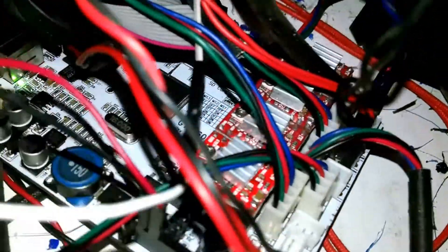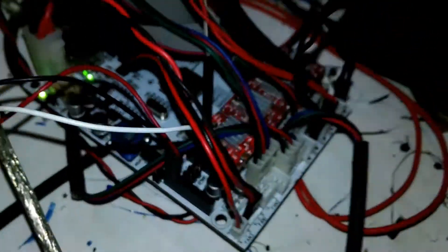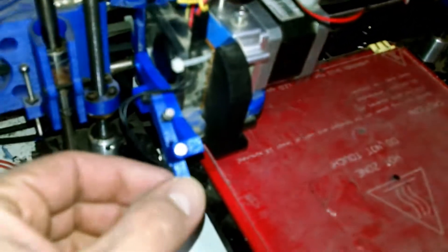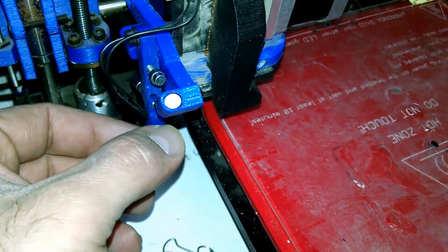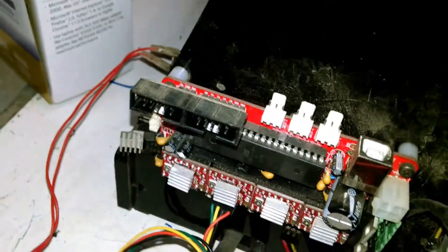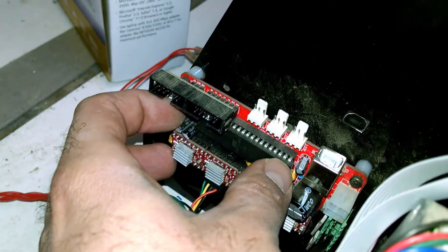It compensates this distance from the reading in the firmware. As you can see, I'm using a GT2560 — I did add a wire to the analog over there. I also did the auto-level, and the reason I did it this way with no servo was because in the beginning I had a Sanguino, which is actually still right there. I'm only doing testing for this — it's one of my favorite boards because it's got so many interchangeable parts.